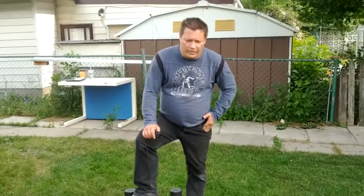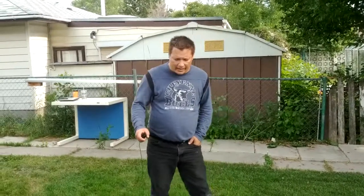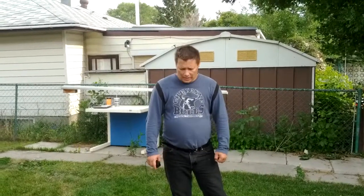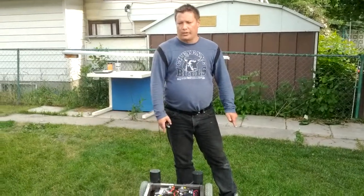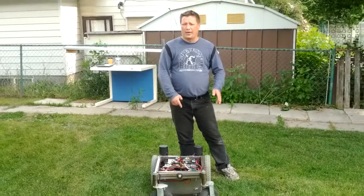One of the major things that we noticed from our review on how the mutant chairs worked was that there were definite turning issues on all the furniture. One of the things I didn't like was that you couldn't just turn on a dime. The reason for that is the software was designed so that both motors could operate either forward or backward, but not both. So the first change I made was to modify and clean that out.